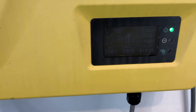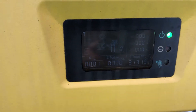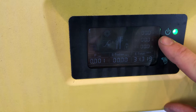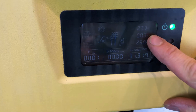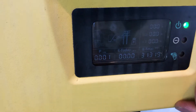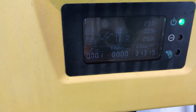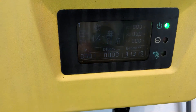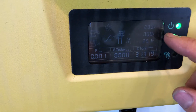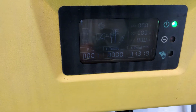If we go in and have a look at the screen — if you tap on the screen it should light up. Here on the screen we're getting a voltage from DC: 233 volts on input one, but the amperage is zero. That means the system's not producing any power at all. You can see the power being produced is 0.001 kilowatts — it's not doing anything at all. So the green light is on, it looks like it should be working, but the actual system is doing nothing. If you're getting zero amps on both DC 1 and DC 2 and AC amps of zero, it means the system's not producing any power.